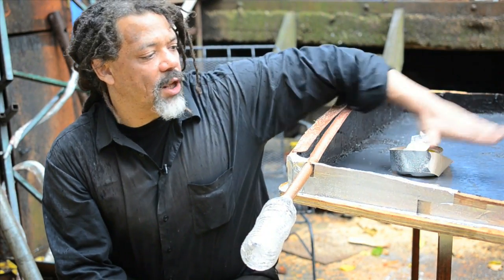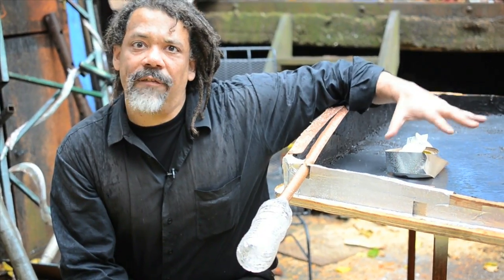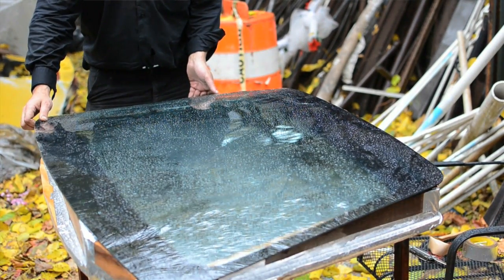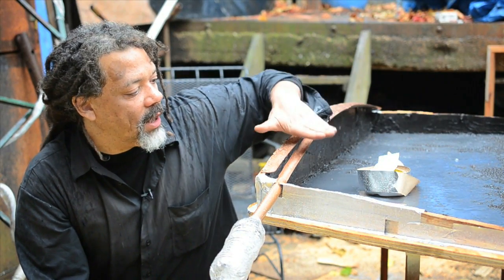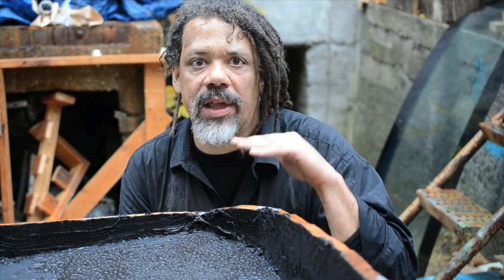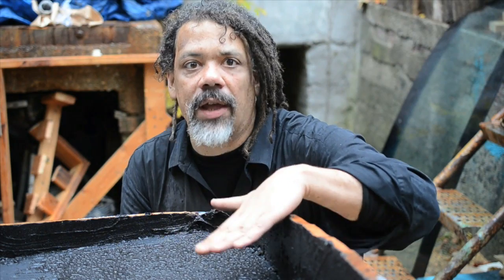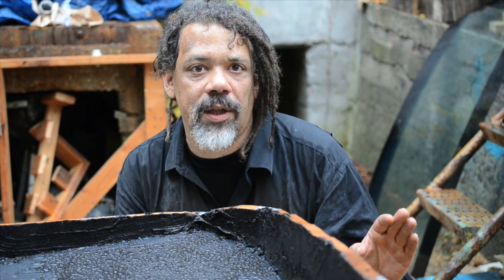You take a reservoir of nasty water, like the ocean. You put in sunlight. Sunlight evaporates the water. It goes and hits the glass, which is kind of like the upper atmosphere, and condenses like rain. Instead of raining down, it beads along the glass until it hits this gutter, and it goes through the gutter into a collection vessel. When the water evaporates, everything that is heavier than water is left behind — so bacteria, heavy metals, rotting dolphin parts — those all stay in the sludge at the bottom. Some of the lighter hydrocarbons, like acetone or gasoline, will rise with the water, but they come off first. So you just throw away the first bits of water from the still, and you're good to go.